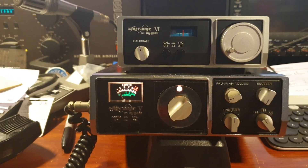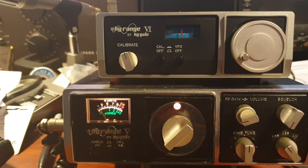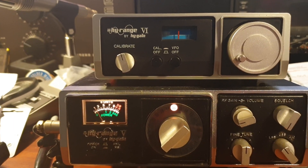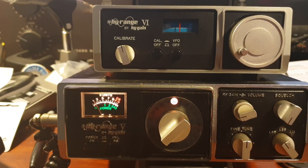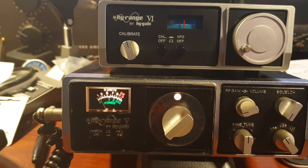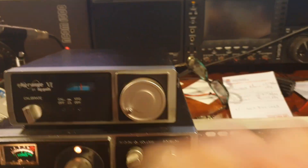It's a really good example of the era. With the 674, I would have thought the VFO was a bit groundbreaking, prior to 40-channel radios and so on. They found a way to come off the existing oscillator and interface with the radio — there'd be a couple of injection points to do that. I'd have to check the circuit. Let's have a quick look at the book, because books are always interesting.